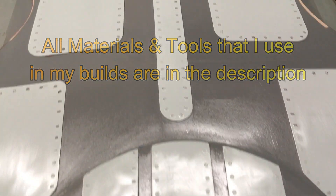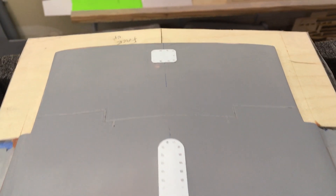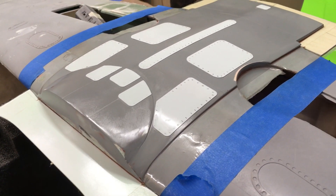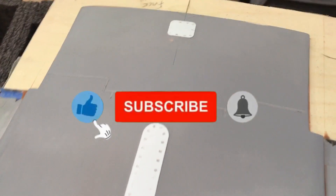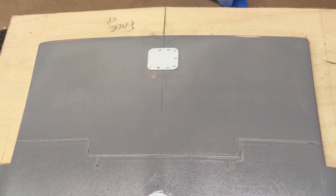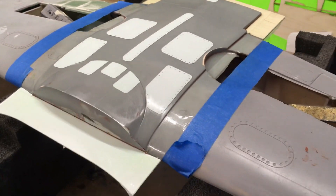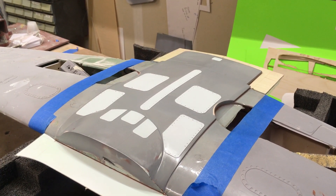It's just done with basically Bondo body filler from a vehicle and I'm just going to mould it so it gets the complete curvature of the wing. This area here will be a speed brake, so you can see that I've already got the hinge locators in and a heavy panel line which is where I'm going to do the cut. I'm just going to sploge this up, put some tool coat on and lay it up.